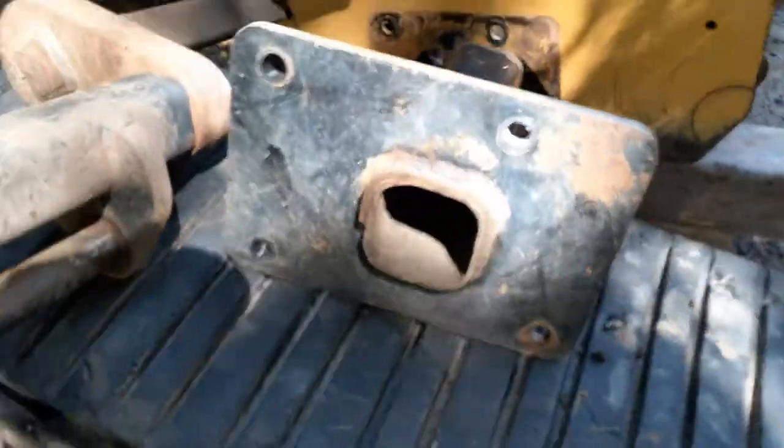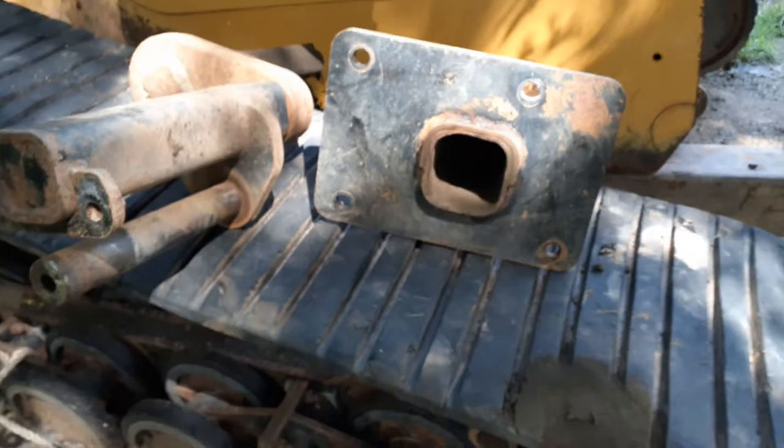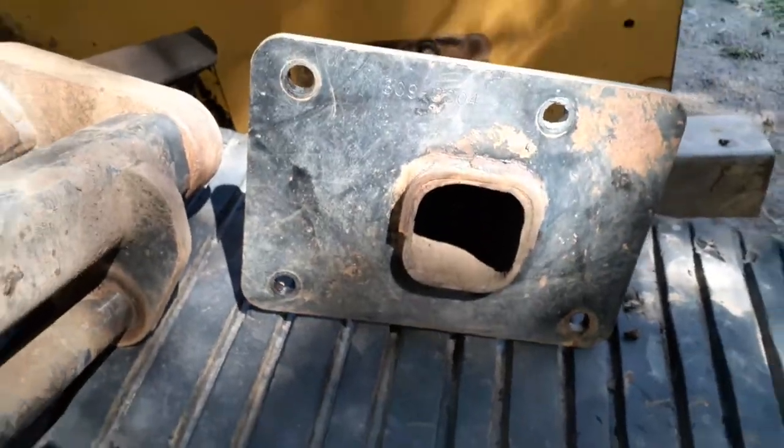This is how you get it apart. Mine broke off on the inside — it's hard to see in there, but on the end it looks like it just stripped. It's got splines, or it feels like it used to have splines. It separated on the inside, probably missing some rubber. On enclosed trailers and trailers in general with torsion axles, they have rubber surrounding a square tube that inserts in here and creates your suspension, opposed to leaf springs.